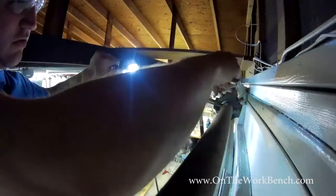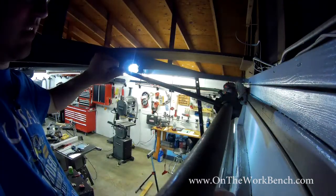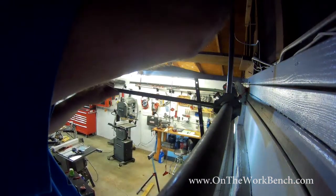now I have to begin the unwinding process. See, these are both loose by fingers. Set the ratchet down, and now I'm going to count the number of quarter turns that I make with the winding bars.